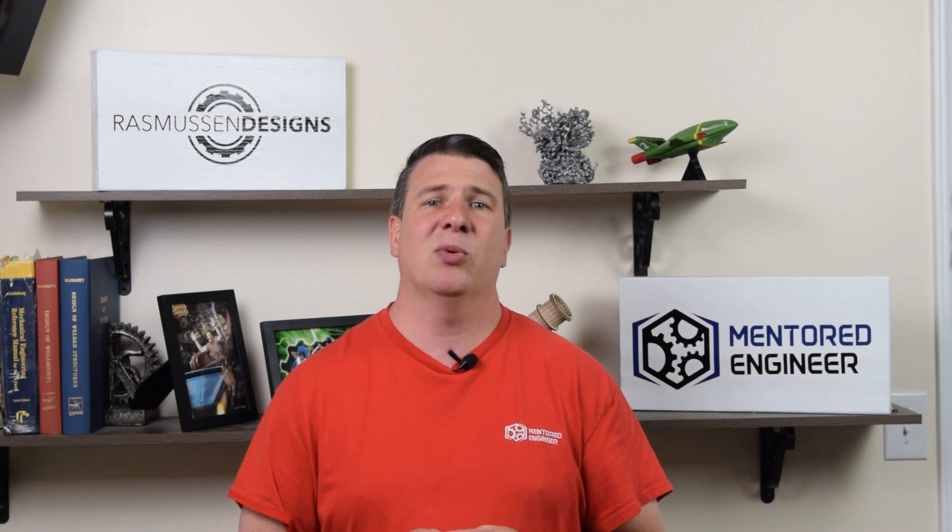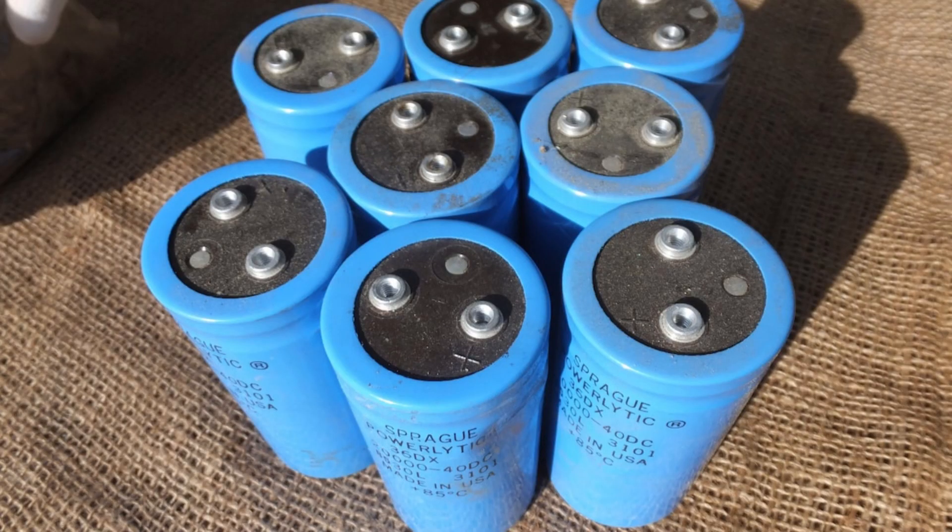The purpose of this video is to talk about how we're going to run our three horsepower motor that's going to control the launch system. Our DC motor is going to take between 30 and 35 amps at its peak to operate. I don't have a power outlet that's going to provide me with 35 amps without breaking a whole bunch of fuses or burning up wires, so we're going to charge a large bank of capacitors off of a 120-volt source.